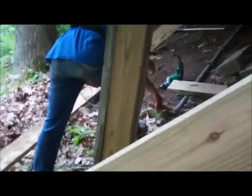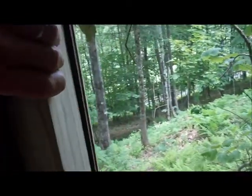All right, we've done some serious work here. Needed some major bracing. A few new pads. We've majorly braced it, stiffened up everything, and literally made everything stronger. Got rid of those blocks they had on top of here, that 3.5-inch block they had on top of there. We've stiffened these up. We've added outlookers here to give that some support. Since it's that way, it makes the railing want to twist back and forth when you move it, so we're adding some strength with some outlookers here.